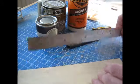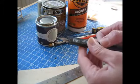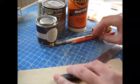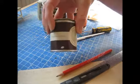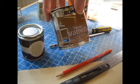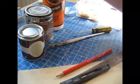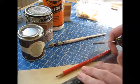You'll need a ruler for measuring and cutting the wood along with your craft knife — this is a Swan Morton knife that takes 10A blades. Always put a new blade in at the start of a project; when it starts to catch or drag it's going blunt. Keep your pencil nice and sharp for more accurate marking. For paint I use Farrow and Ball sample pots, which are just normal household emulsion. I use a normal household interior varnish and my favourite Gorilla wood glue because it bonds really quickly.